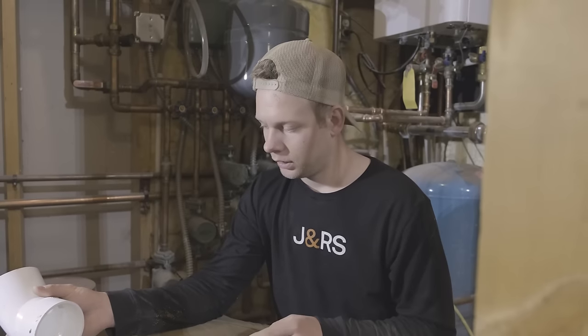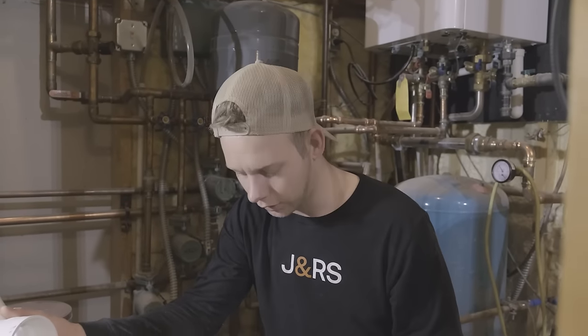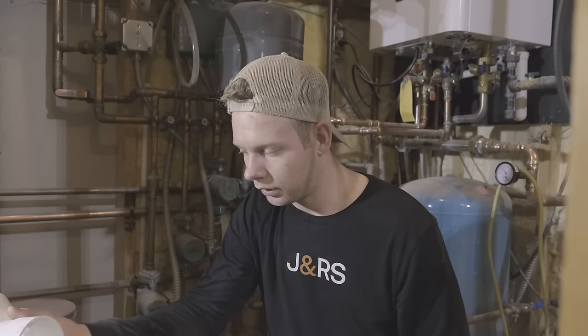I've got to bend these copper lines that are in our way up just a little more so that our drain can get right underneath. The next part is we're going to run our main line over. We want to maintain that quarter inch per foot, which comes out to a quarter bubble on a torpedo level. We'll run this main line over to the bathroom group where we'll have more Ys.